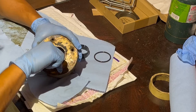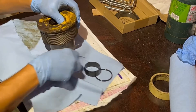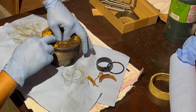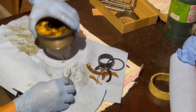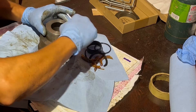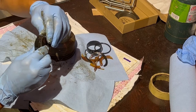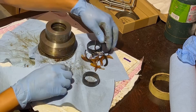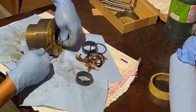The main seal or packing on this gland were very old, as well as the backup ring, and so they ended up coming out in pieces. There is another wiper seal on the bottom of the gland as well as an o-ring behind it. On the exterior of the gland there is another o-ring as well as a backup ring.